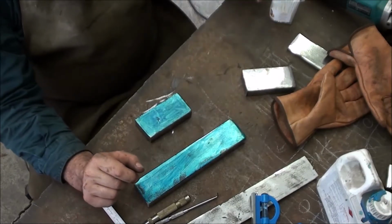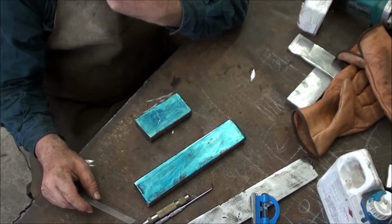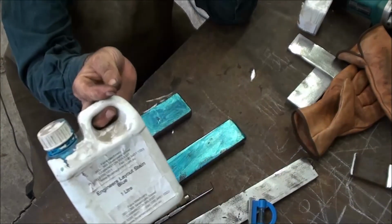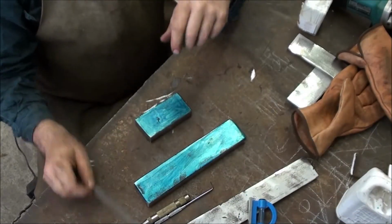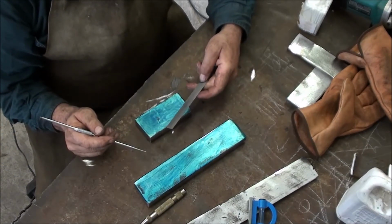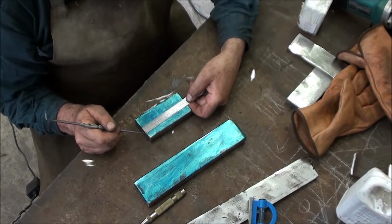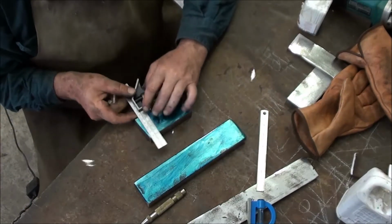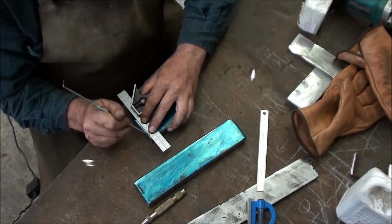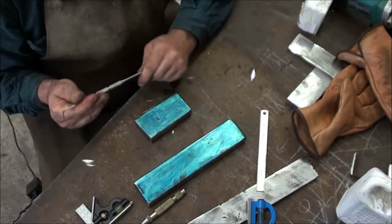Alright, now we're getting to the point where we actually need to have some dimensions. So that means we need to put a bit of a layout on it. So what I've done is I've got a bit of layout blue, giving it a brush with the layout blue. I've shortened one of these blocks down, and when I can see what I'm doing, we're going to have a look. Yeah, it's about 100 mil. We haven't got a square edge at this end, so what we'll do is put a mark in here. So we've got our 100 mil length there,